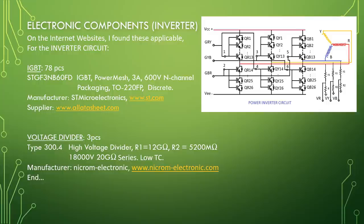Electronic components, inverter. On the internet websites, I found this applicable for the inverter circuit. IGBT, 78 pieces. STGF 3NB60FD. IGBT, power mesh, 3 ampere, 600 volt, N channel, packaging TO220FP, discrete component. Manufacturer ST Microelectronics, www.st.com. Supplier www.alldatasheet.com.